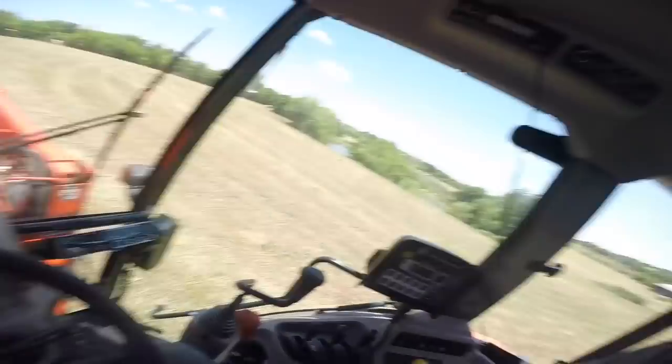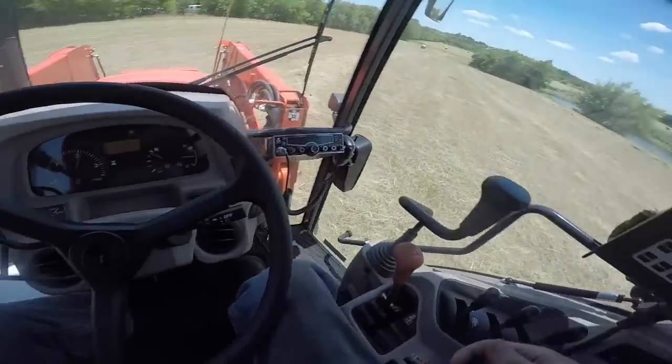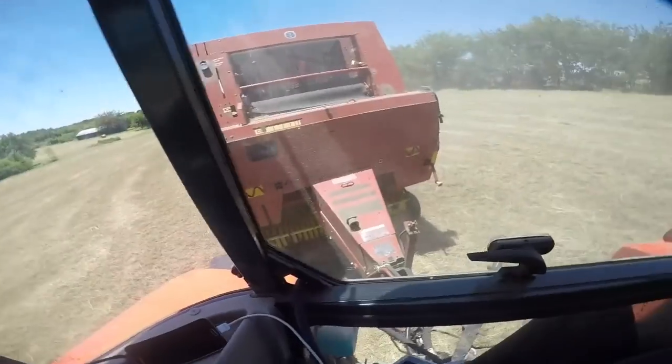We did get off to a little bit of a rocky start with that. Pretty much as soon as I left the house, I made it like a mile or 2 miles perhaps coming over here, and the emissions overheat light comes on the tractor, and I look and that needle's pretty high up there. So I had to stop at a little, I think it was a Dollar General parking lot, and pull the screens out the front of the tractor and knock all the seeds and dust and crap off them.